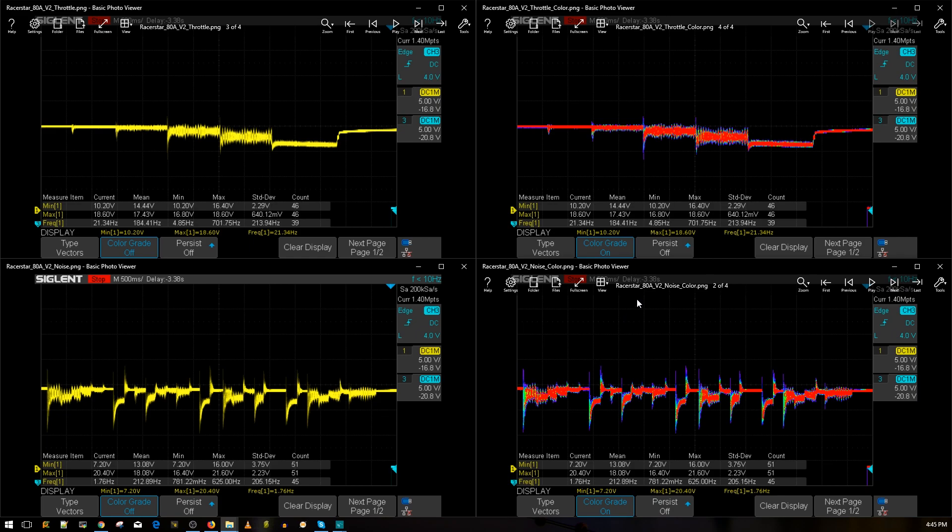Something very important: please start grounding your ESCs. I always thought common ground was sufficient, but there are some weird hiccups I've simulated that I still want more data on. Grounding your ESCs is a must — it prevents a lot of weird things that otherwise wouldn't be explained. I used to just cut the wire and be lazy about it, but now I always ground my ESCs after seeing some strange issues arise when I don't.